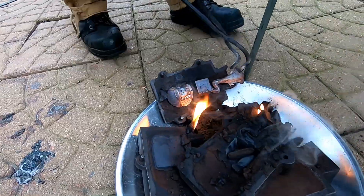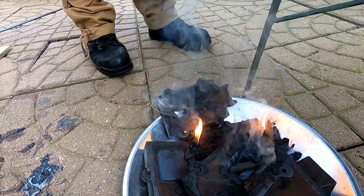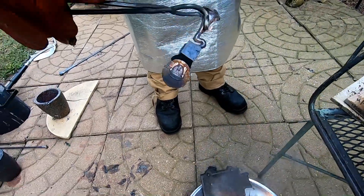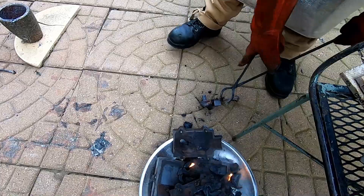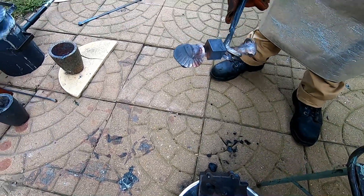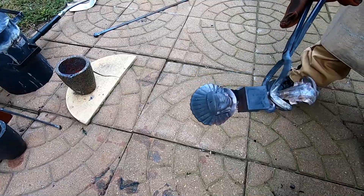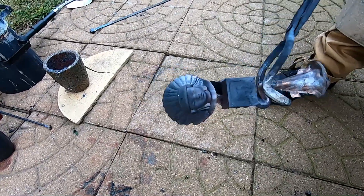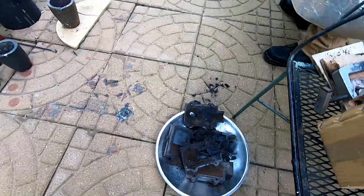You can see the gap block he's got there so that it has time to fill up. That block — when it cools — is going to want to shrink, you know, like candle wax shrinks when it's cooling. It's got a little divot in it but it should still be fine. That's been a common problem on the side, but that's probably just because of the way the metal flows into there. If I make it too hot, then it's more susceptible to hot tearing.